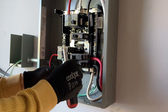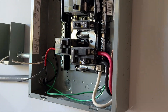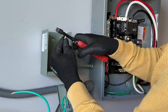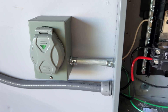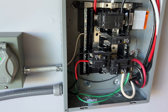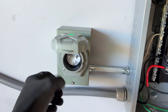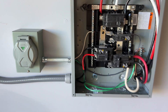After installing the inlet box we can run wires and connect this to the electrical panel. Now when we have the inlet installed and we don't have an interlock, we can activate the breaker and we have power inside this inlet. That's why we need to install an interlock — so we have only one source of power, either grid or vehicle.